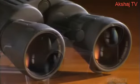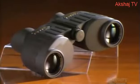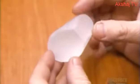The objectives are curved, causing the image to appear upside down. To turn it right side up, each binocular half needs a glass prism. Using UV light activated glue, workers mount several prisms on steel plates that take them through a series of grinding and polishing steps.